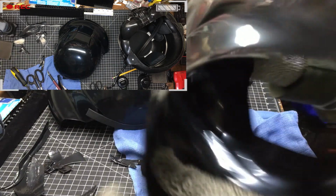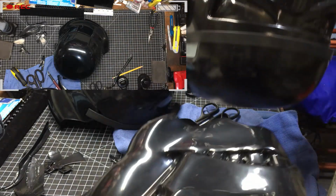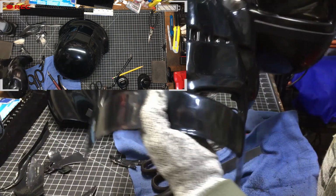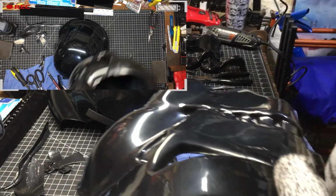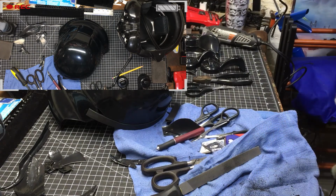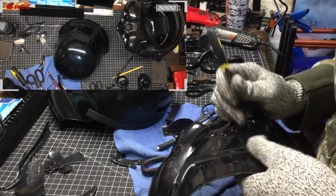So that's looking very good. Again, the teeth are going to be time consuming. I might do that as another video or just start working on them and show you the finished product, because we have to get from these holes to much larger holes, basically just keeping that shape, and I like to keep a little bit of that ridge, that curved ridge there, so that you can see the screen behind it. So that's going to be a little more time, and basically again it's just working with these various files. You could do it, you know, with a drill and try to drill them out. I think it makes too much risk of scratches.